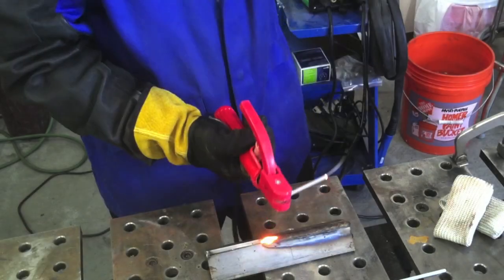I'm using a pretty close arc length here. This is the Hobart rod first — 3/32nd 7018, 95 amps, electrode positive. Nothing wrong with that. I'm speeding things up here just so you can watch the pinky-thumb collapse movement. I'm making little small circles — it's exaggerated here with it going faster — but in my mind's eye I'm making little small movements. That just kind of helps me progress at an even rate. You can also just drag the rod dead evenly, but this works better for me.